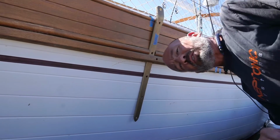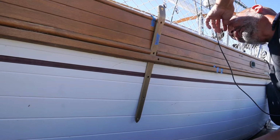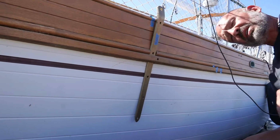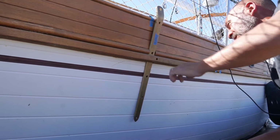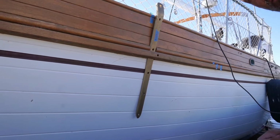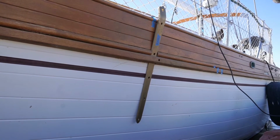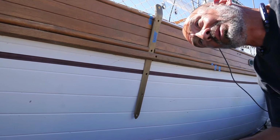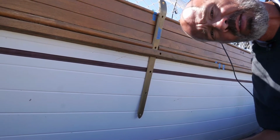Alright, so that's pretty much it for today. I got these mortised into the rub rail, and I just need to drill and through bolt these things into the appropriate lockers on port and starboard side. Still got to do some cutting, same thing I did, cutting and mortising out on the rub rail for the cap shrouds, and the next one back is the dog bone with the aft lowers and the intermediate shrouds, which go up to the staysail stay.